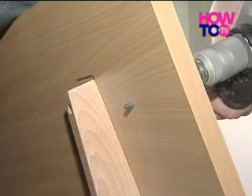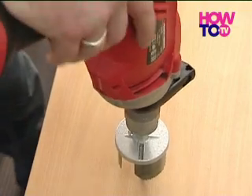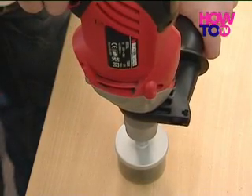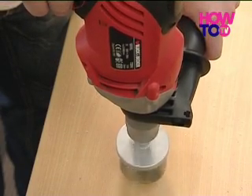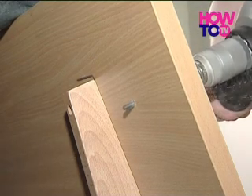Then drill a test hole with a smaller drill bit, which will pave the way for the larger cutter. If you're happy to proceed, fit the cutter and align the protruding conventional drill bit with your test hole. Drilling slowly at first, work through the desk with the regular drill bit, stopping short of the point where the serrated cutter meets the desk's surface.